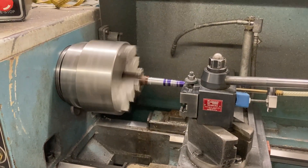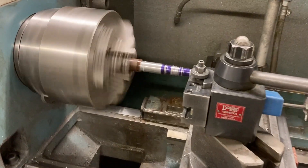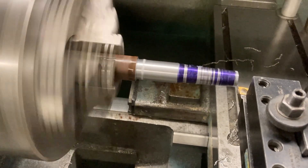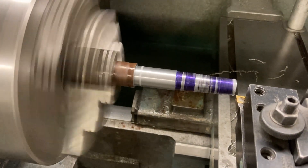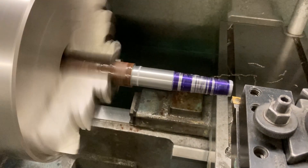We're back. Now we're rough cutting the actual profile of what I want to produce here. Because we had already cut down the front with the test taper, I've been roughing this down, but I skipped over that because I was cutting a lot of air in the front end. It had already been turned down below the roughing diameter, so we're back to roughing here.